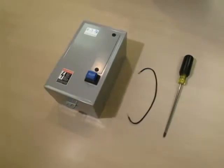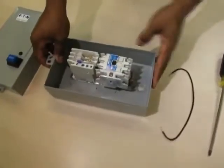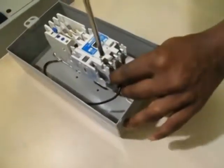Here we are showing a standard non-combo enclosed control kit required to field convert a three-phase starter to single phase. We have the following part numbers: ECN0501AAA and a power wire. The size of the wire required is based on the motor horsepower. Please reference Table 10 of the Enclosed Control Quick Selector Guide for sizing.